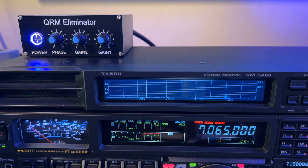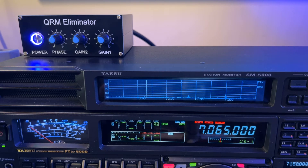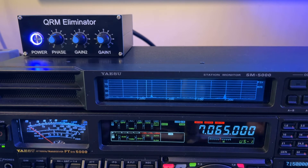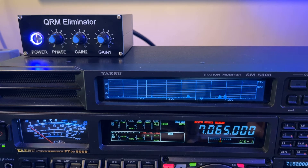This video may be too much for some of you if you're new to this. Let me give a little background: the older amplifiers - I have one sitting over here, they still make it, the Ameritron AL-80B - it has an RCA plug on the back that needs that TX ground to transmit, so it knows to transmit. And even then it pulls in a big relay inside of it.